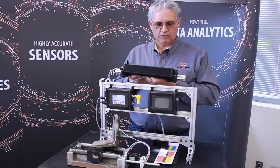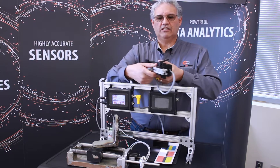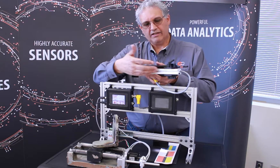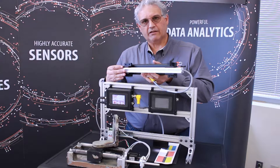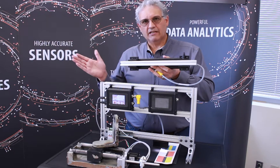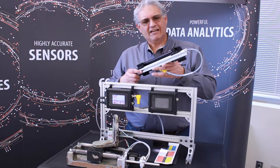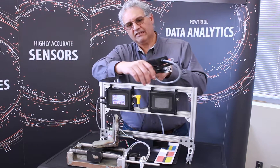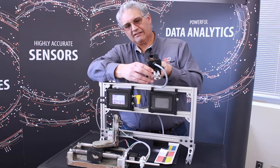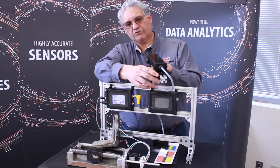You have the 221, and on the back side you can see the bracket we would use to mount it on a rail made out of 1-inch extruded aluminum, which can go any width that you require. It's a very simple-to-use bracket — it has a lever that acts as a brake. Once you release it, you can just slide the sensor easily into position, and once in position, you close it back up.